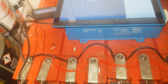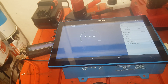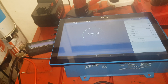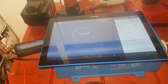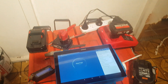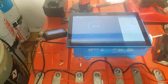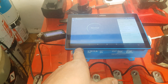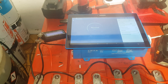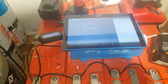We'll let this rip and see what happens. I'll make some more videos on the progress — hopefully they don't fall over and can sustain continual discharge for a long time. Discharging to 11 volts is really a 100% state-of-discharge test. Nerla24 did a video on these years ago — we got a ton of these, pretty sure they were the same, from a scrapyard as well. I'll update you as I go along. Thanks for watching, catch you on the next vid.